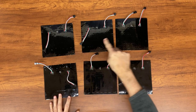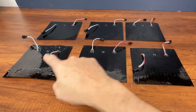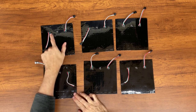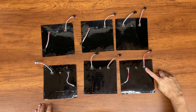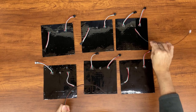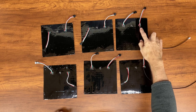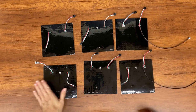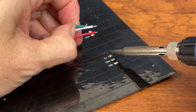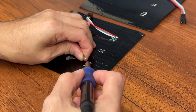The microcontroller will handle two rows of LED matrices separately. Each row will consist of three matrices. The terminal wire of the last matrix of each row can be removed, while the input cable of the first matrix of each row must be replaced with a longer cable with a JST connector. The data comes in from here. Let's start by removing the cables that are not needed and then connecting the new cable with the JST connector.